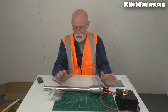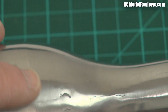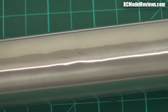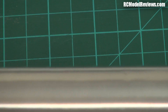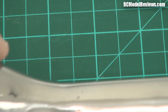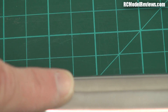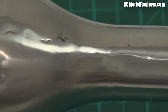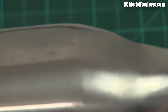Let's take a closer look at some of this welding. It's pretty bodgy — you can see the amount of grinding that's gone on, and even after grinding back there are still inclusions. It's just TIG welding — you'd think they would have done a better job. There's so much grinding and mess here. They should have put a sacrificial edge on as the Dynajet did. Look at all the dimpling and bending that's happened because of the bodging — that's really bad. But it's $99.